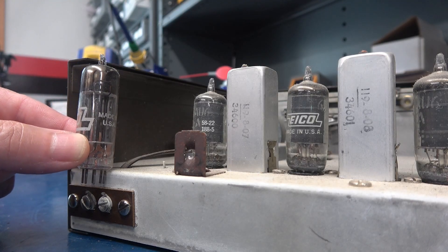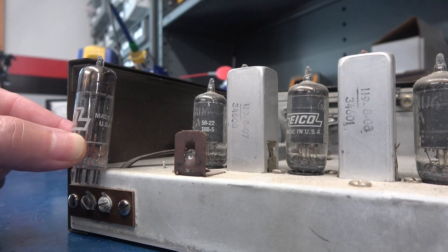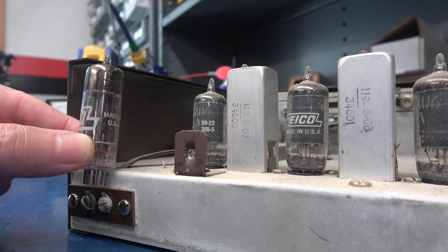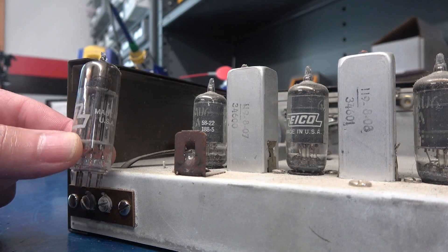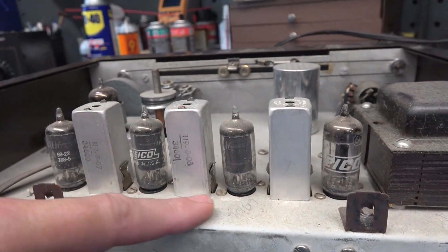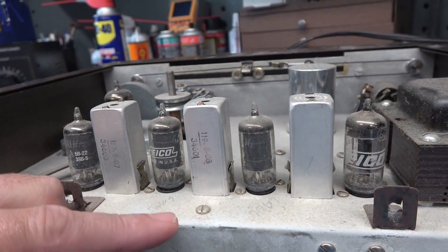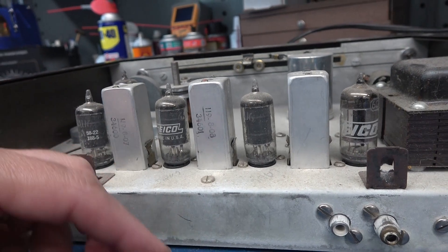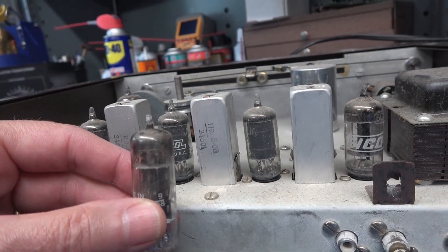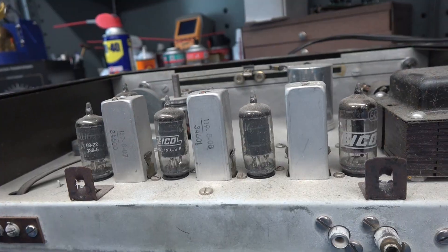So if this were to plug into the chassis vertically, the tip of the tube would hit the top panel of the cabinet, and that's not good. My plan is to lower these two seven-pin sockets using standoffs approximately a half inch lower, and then these output tubes will be sitting into the chassis slightly and allow clearance for the top panel.